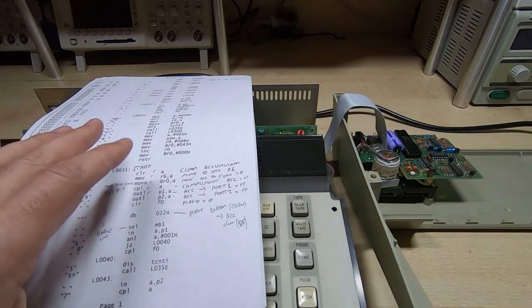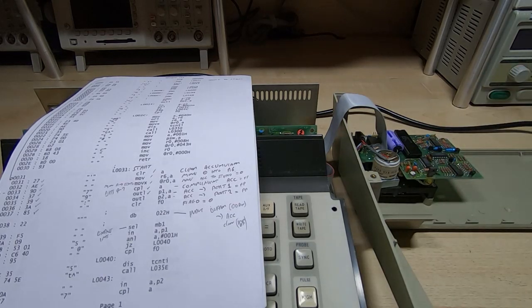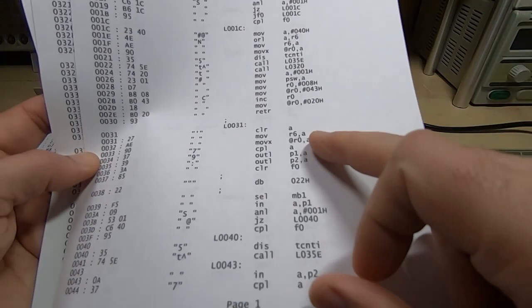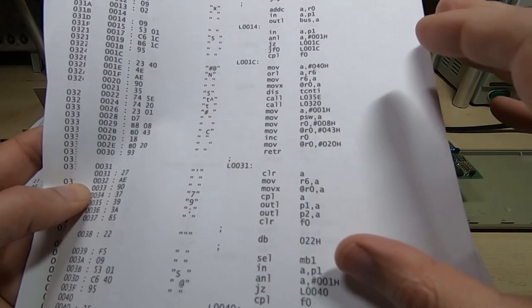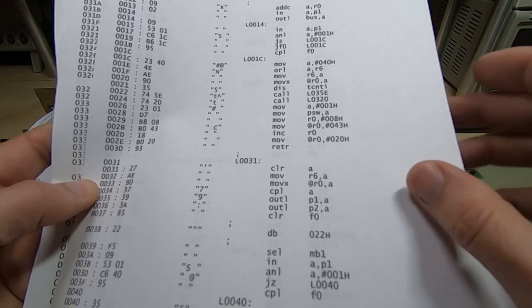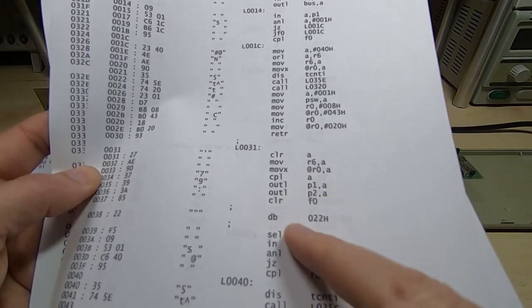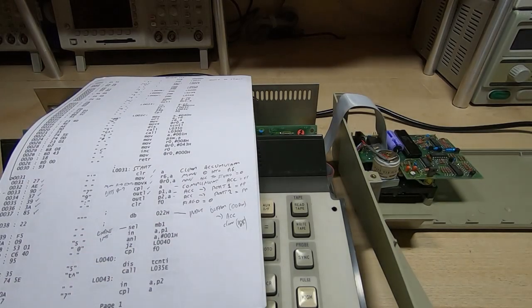I would say at this point that this device, like a PIC, the program code is banked, as is the memory. So just to make sure that wasn't causing any issue, I also tried decompiling it in separate banks. Each bank I tried decompiling separately, but I got exactly the same thing. I tried all manner of settings, I even tried disassembling it using threading, and that wasn't really successful on this device. Either way, it always came up with the same problem here. It didn't matter whether I used independent banking or did it all as one combined file.